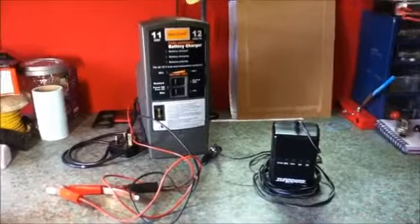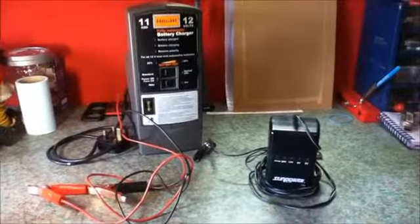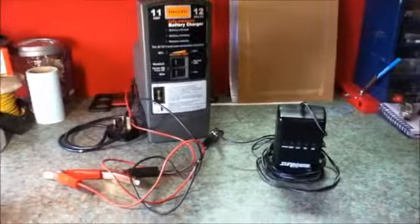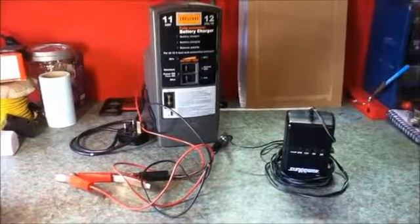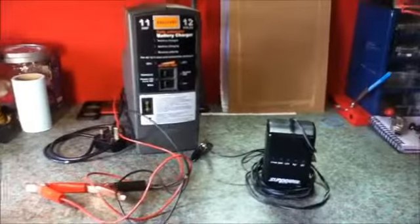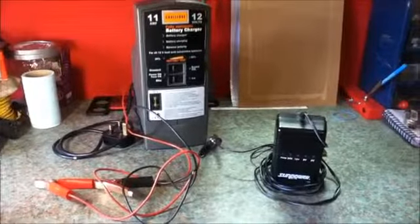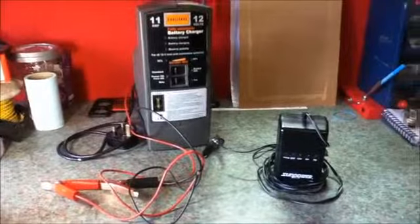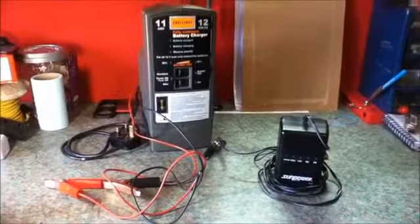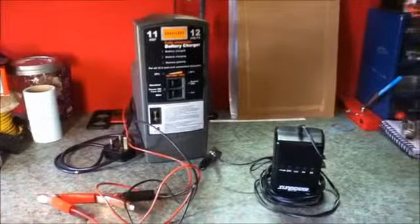These battery chargers can detect when your battery is getting full and switch to a maintenance charge to stop your battery from getting overcharged. Overcharging your battery is almost as bad as undercharging your battery. With the sealed type batteries that I recommend you to use, if you overcharge them for long periods of time, they will vent out gases from inside the battery, but since you can't add more water to replace the gases lost during overcharging, your battery will die earlier than expected.